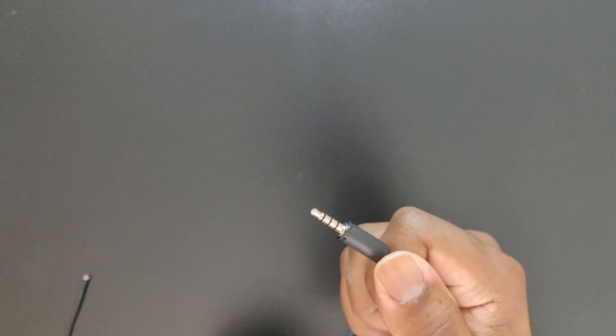Make sure you have the cable inside the connector like that, then you screw it down. Especially on these types you're really going to have to use a set of pliers to get a little bit of extra grip. Just rinse and repeat that process — bring it down, push it in, make sure it doesn't come off the top, then tighten it down.